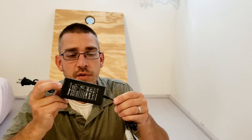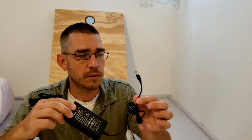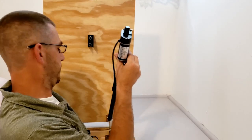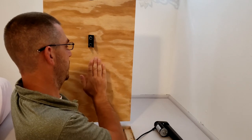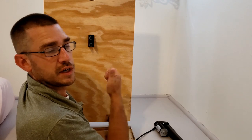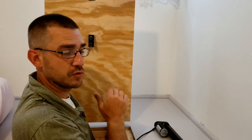It's working pretty good so far but we need some adjustments. The piston was working but super slow — the power supply I had hacked off an old laptop piece just wasn't quite powerful enough. So I ordered an Amazon Basics power supply that matches the amperage and voltage specifically that the piston calls for. I think it'll probably go about twice as fast, so that should be sufficient. I also found that mounting the piston this way instead of the other way works a little better. The way I had it before, it was pushing too much to the side and pushing the trap door into the jamb or frame instead of lifting it up. Flipping it around seems to give it the extra angle we need, so we'll run it upside down.